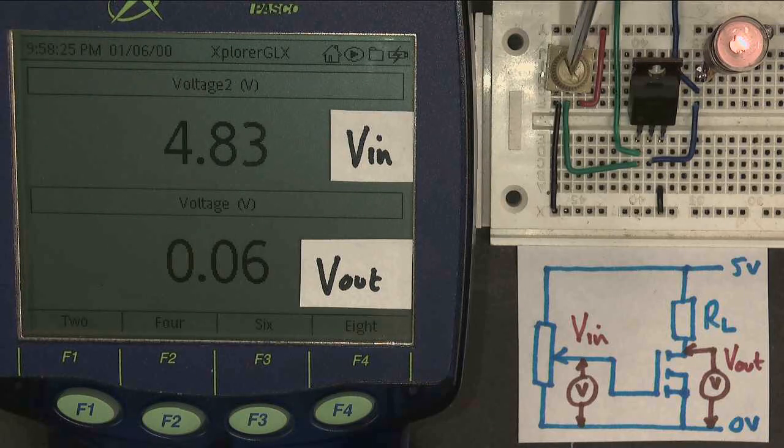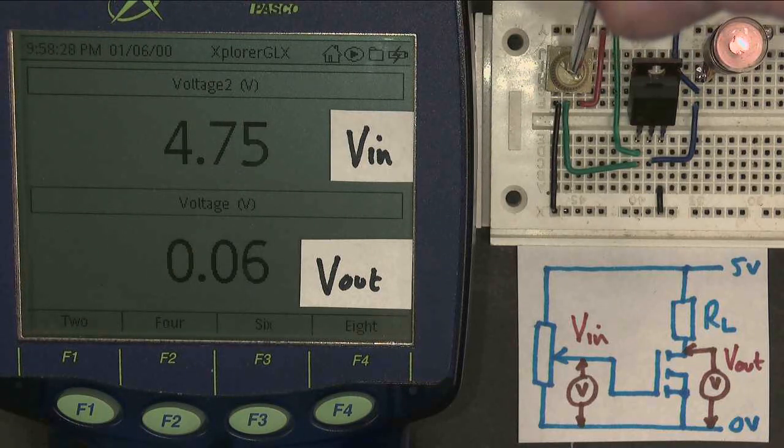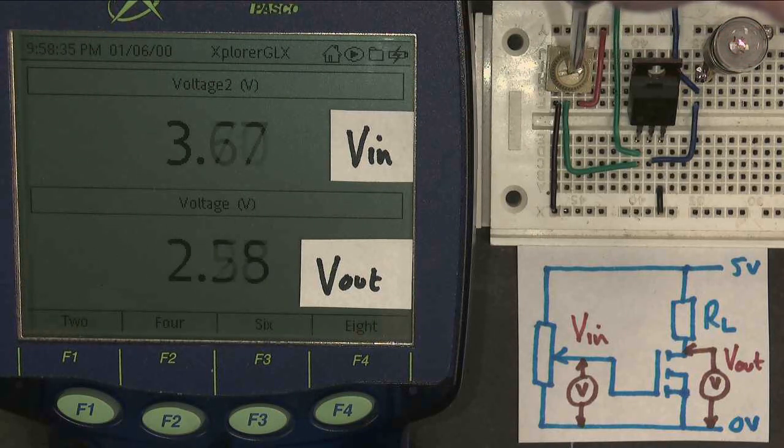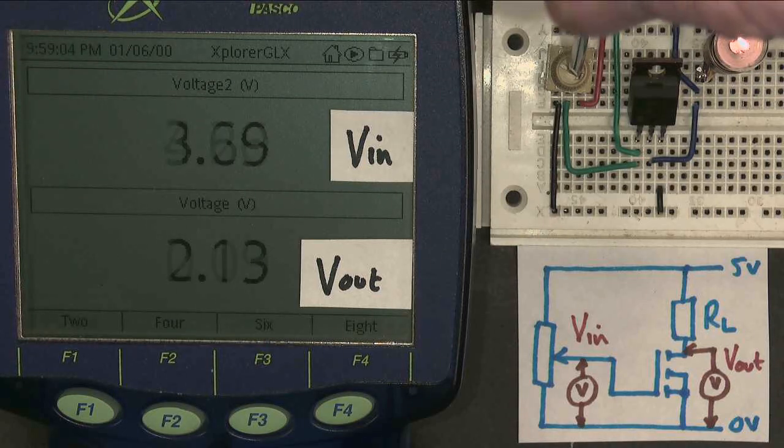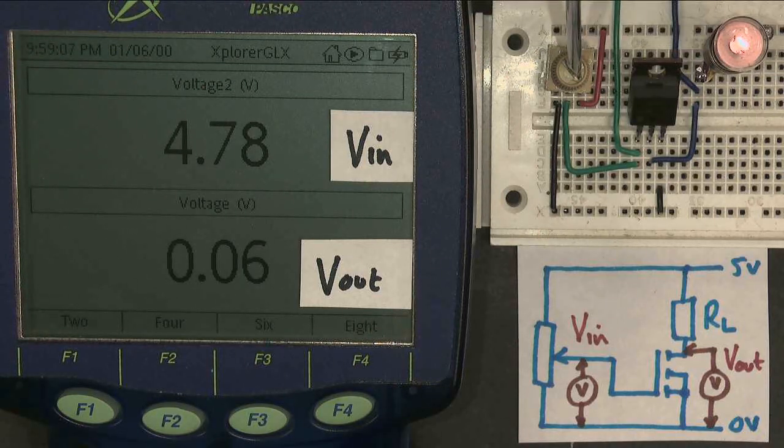If we go back the other way, we have to be careful that we don't use our MOSFET in this region. Because what's happening now is that we've got about 5 volts in total, but 2 volts are being dropped across the MOSFET. There's still current flowing through the bulb and through the MOSFET, so now the MOSFET will be dissipating a significant amount of power and could get damaged. So when we use the MOSFET as a transducer driver to control the load, we want it to be fully turned on — we want to make sure the gate voltage is high enough so that the voltage across the MOSFET is as close to zero as possible.